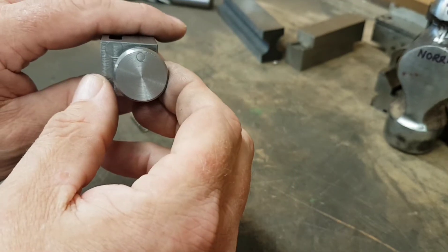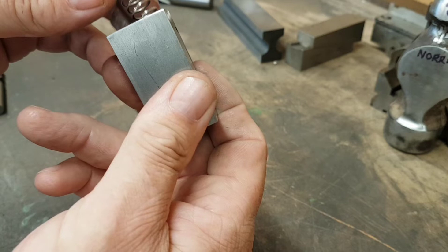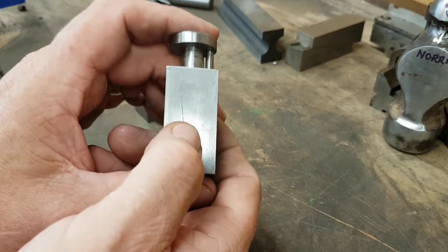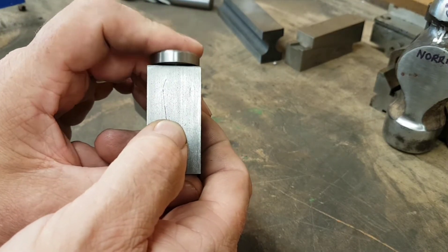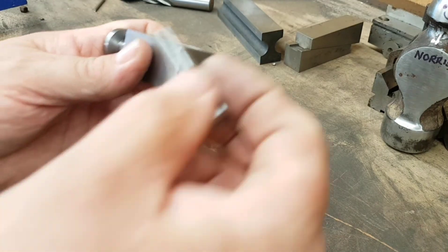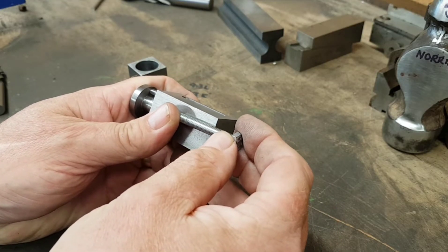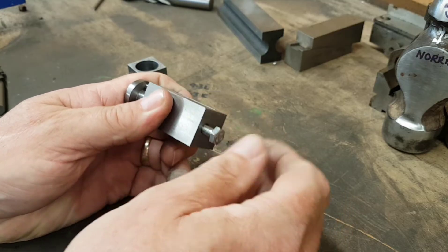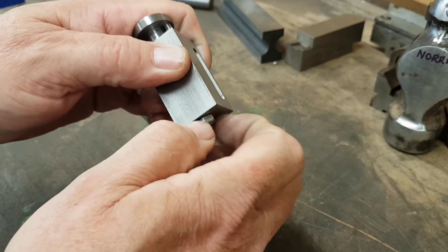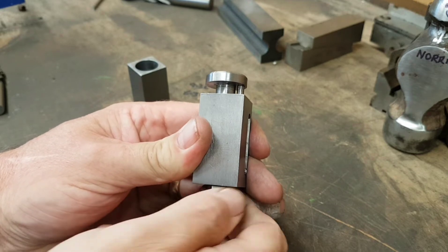So if we take the spring - the little coiled escape artist - you drop that in there and you end up with a spring-loaded plunger which can't rotate. Kevin has also made a modification where instead of an Allen bolt he's now made a knurled nut to fit on there, and as you can see I should be able to tighten this by hand without the need of a spanner. If I hold that there you can see as I tighten it, it pulls it down.